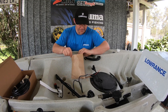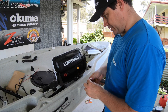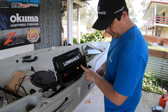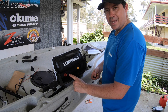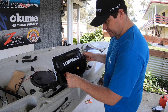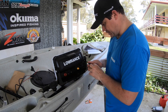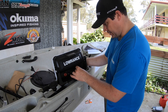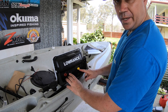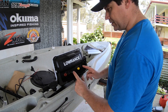We're really only interested in power and the transducer. So that's our power receptacle. This is our transducer receptacle here. This is our NMEA-2000 and this is our ethernet — I'm not going to use these. It's a good idea to just put those caps on and protect them. That's just going to stop any water egress or anything like that, especially being in a kayak, quite close to the water. We don't want anything splashing up in there.